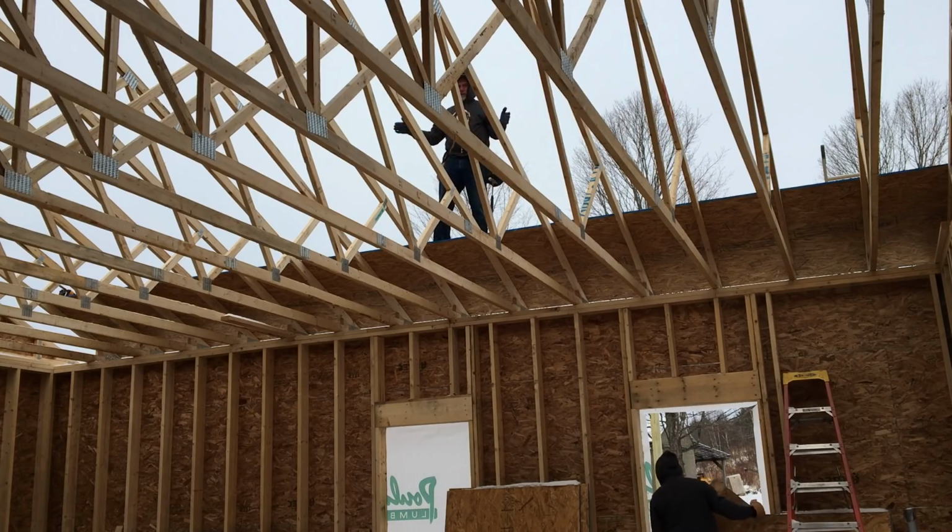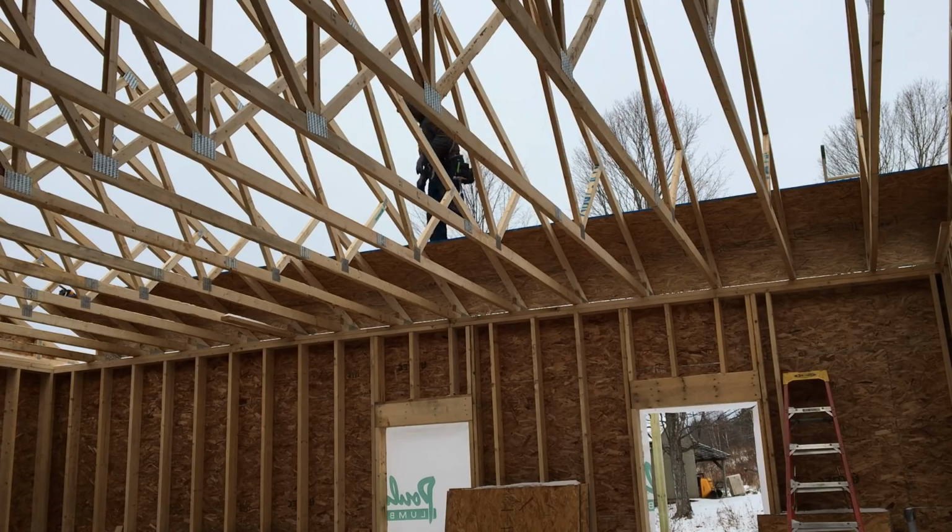This building being 30 feet, we start with a 5-footer, gives us a foot overhang. Then it's 3 8-footers, and then we finish with a 3-footer, and that gives us a foot overhang, so there's no waste at all to the sheets. I think it's 4 courses going up, 4.5.